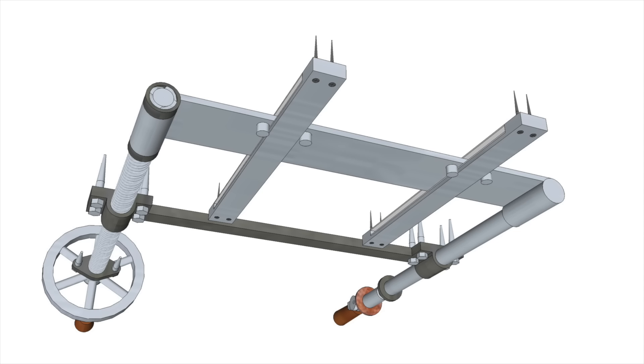The bottom side of the plate would have pins to maintain alignment and avoid over-torquing the nut when the cam is tightened. Material for these is to be determined — brass maybe for low friction, we'll see.